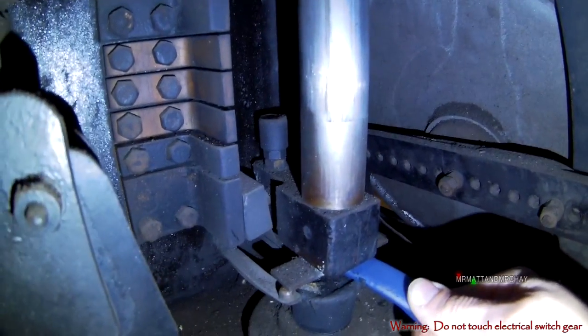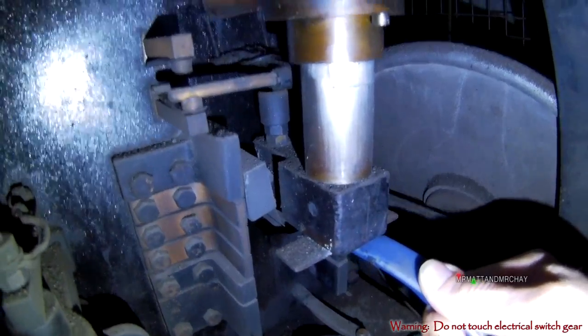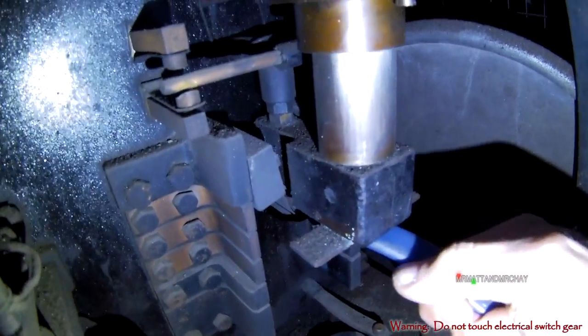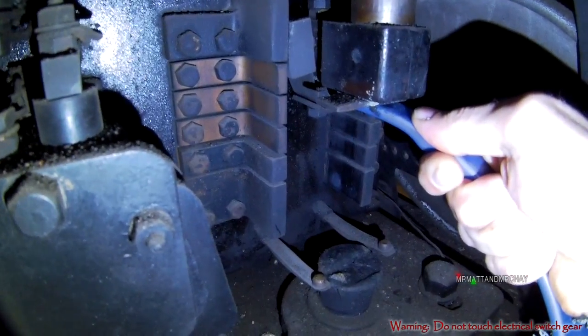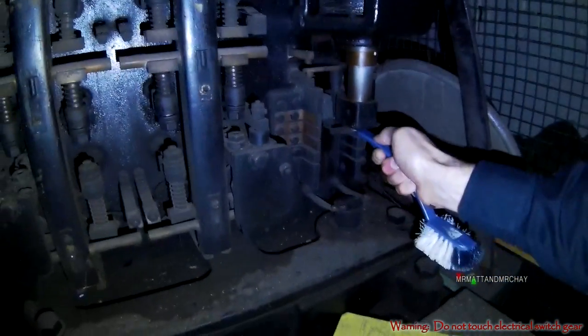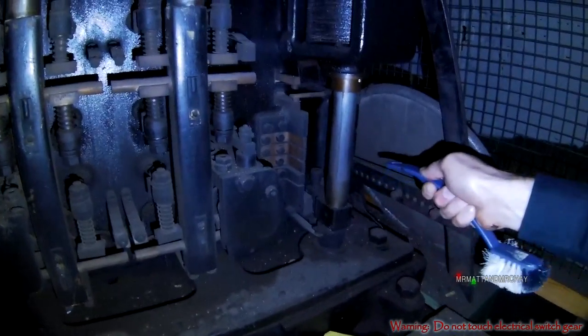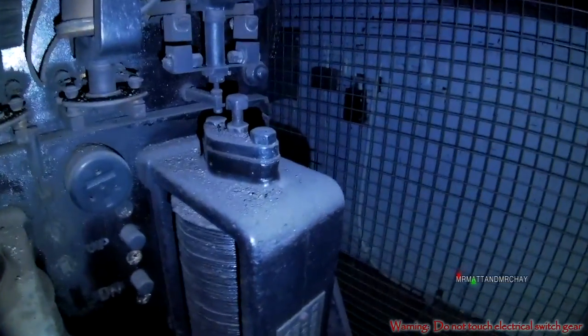As the accelerator rod rises, the six switches gradually bypass the resistors in the cage until it reaches the top, where all the resistors are bypassed, allowing the motor to achieve full speed. The rod is pulled up by the massive electromagnet. This whole unit is just a very crude speed controller.